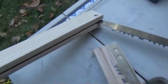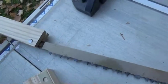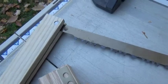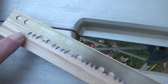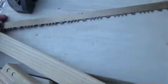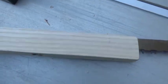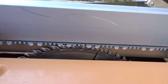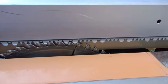I need to cut a slot in one piece of wood and make it so that it folds completely. The first thing I'm going to do is set the depth of the saw so I can cut it deep enough that the entire saw blade can rest inside it. I set the depth on the table saw so it's just deep enough to cover the blade of the bow saw.